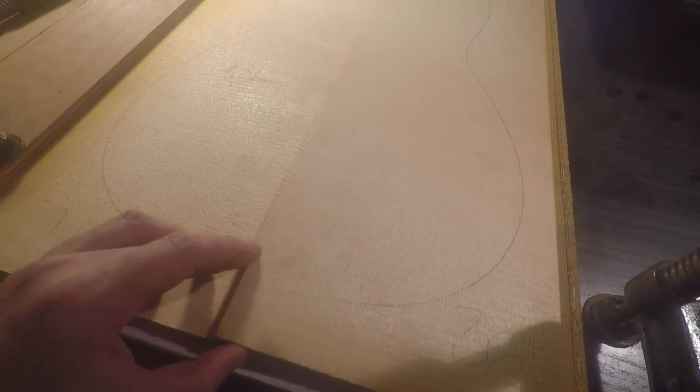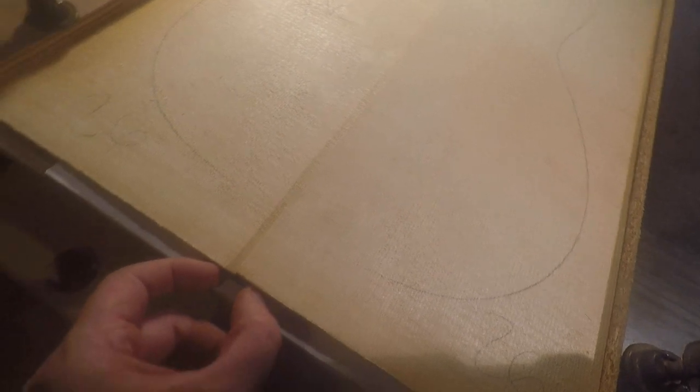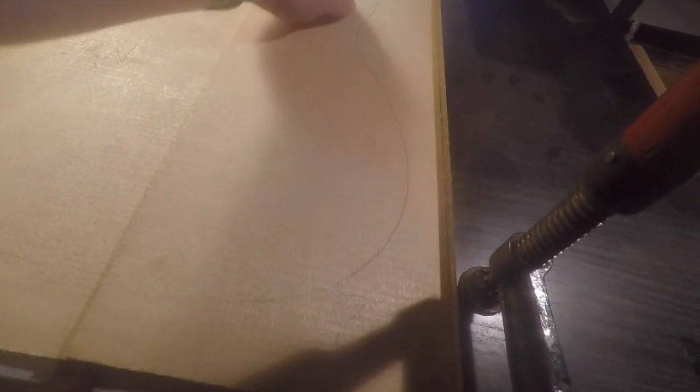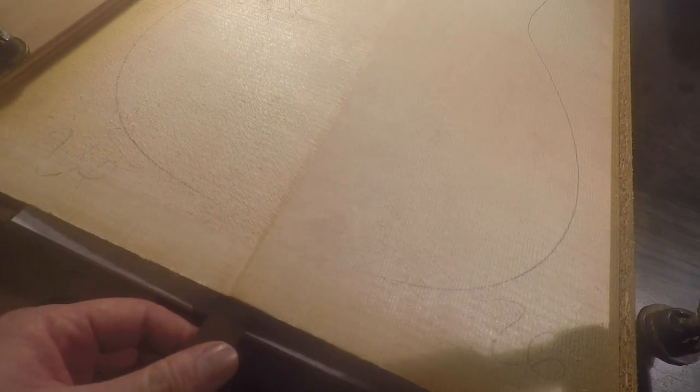When we put the glue on both sides, we put them inside and we pull out the little piece of wood that's keeping the two pieces of the top plate a little higher. We pull it out and we push the plate down into the base plate, and now the two sides will put pressure on the wood. We are also going to clamp another piece of wood on one of the sides to make sure it stays down. It won't pop up like this because of the pressure.